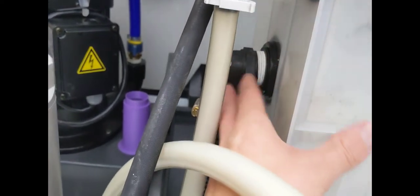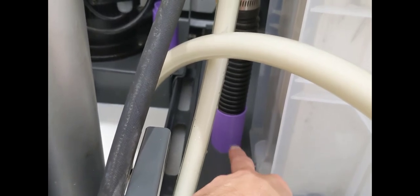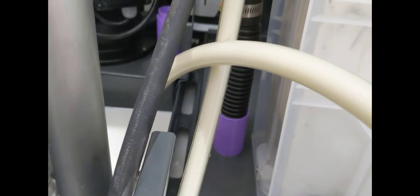The line you see is where the level drops when I turn it off — that's why there's gunk at that level. On one side of the coalescer it settles; there are two sides separated by a partition. Coolant comes through a little port into the cleaner side, the level rises, and the outlet is on that side — it goes right to the top and waterfalls over, so only the material that rises to the very top comes over and falls back down into the coolant tank. I 3D printed a fitting that slots into holes so if I knock it, it doesn't come out and spray coolant everywhere.